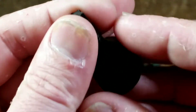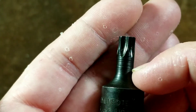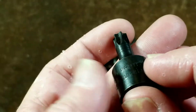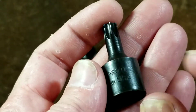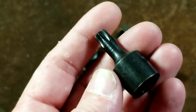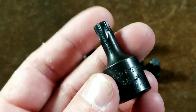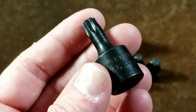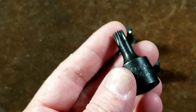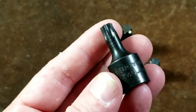If we take a look at one of these 3/8ths ones, you can see it has like a hand-machine feel. These come as a steel billet rod, and then they machine them down rather than forge them, just because upgrading to forging dies and forges is real expensive. And when it comes to smaller things like these star sockets, there's not going to be very much difference.